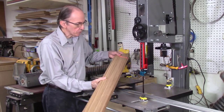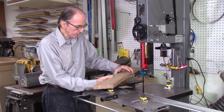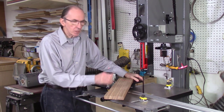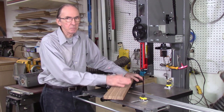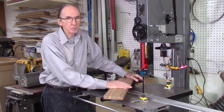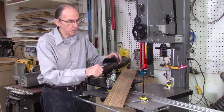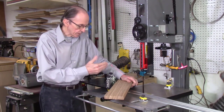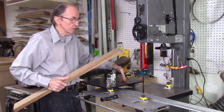I'm ready to cut this piece of zebra wood into slices at a 45-degree angle, making thin slices between an eighth of an inch and a quarter of an inch wide, for use as the center sections of the herringbone and rope-tooth designs. There are a number of ways I could cut this board — on a table saw, but the kerf for a table saw blade is an eighth of an inch whereas the bandsaw is only 45 thousandths, so using the bandsaw is much more efficient and you lose a lot less wood. I decided to use the AccuSlot because it supports the board on both sides of the bandsaw blade.